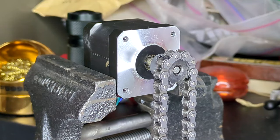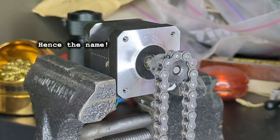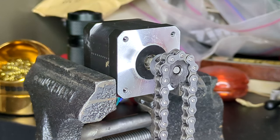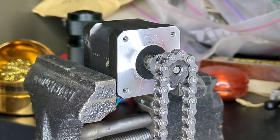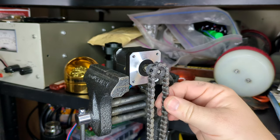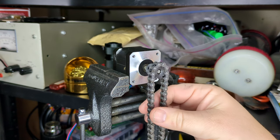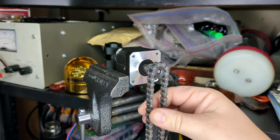But it can repeatedly and precisely rotate by some small amount, so its controller can just keep sending commands and keep track for it, as long as there isn't too much torque fighting against it. Enough torque can overcome the internal magnetic forces on the rotor, forcing it to rotate, and the controller has no way of knowing if and when that happens. So they're best used in contexts where the forces are known to be limited, but a large amount of rotation is needed, such as CNC tables or 3D printers.